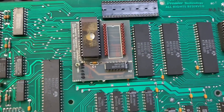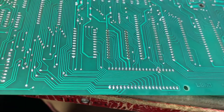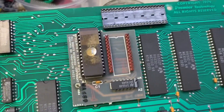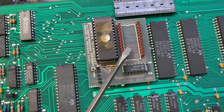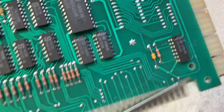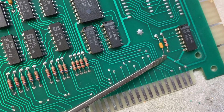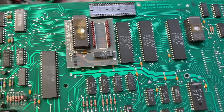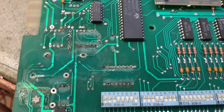This also has the original daughter board on here, and the good news is nobody's worked on this one before. There are blind solder joints on the bottom side, and they develop fractured solder joints on these pins, so those are all going to come out. I'm probably going to add the slam switch mod by connecting the bottom part of this resistor and capacitor, because I think Spring Break is one that wants to have the slam switch closed.